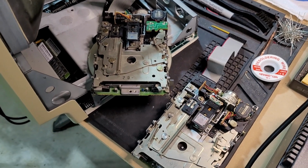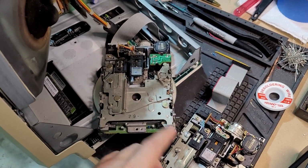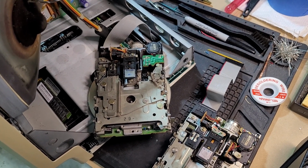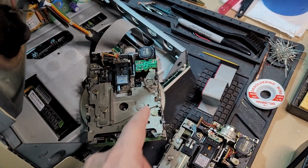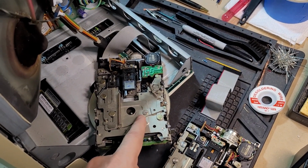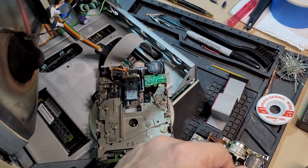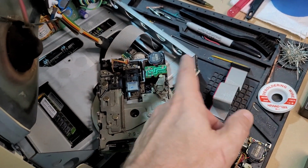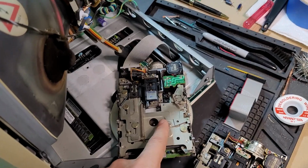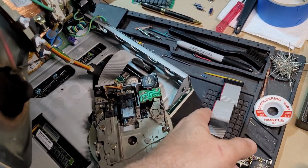So the fact that the disk drives were ejecting over and over again is because at some point Apple decided not to carry through a couple of pins. On these new drives, if you use this old cable with all the pins connected, I believe there's 2 that don't need to be connected, it will either ground or cause a signal to get to this drive where it just thinks it needs to eject over and over and over again, and it's purely because of the cable.